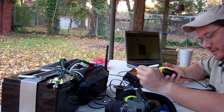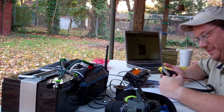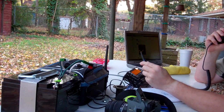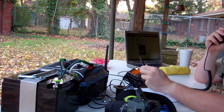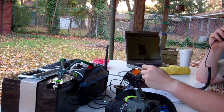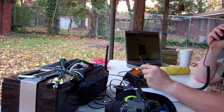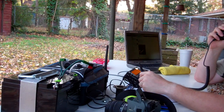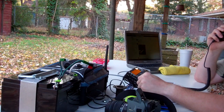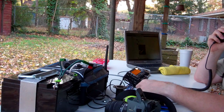Yeah, I don't even know why I bothered buying an amplifier. Well, I actually did it to go to 160. How long is that wire? It's approximately 50 feet. I haven't put the tape measure on it yet because I know right around 52 feet is about what's recommended, and plus or minus a couple of feet gets you in that weird random length you don't want to be running.